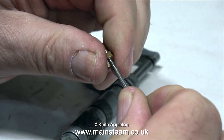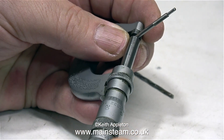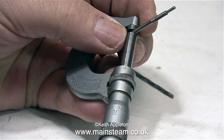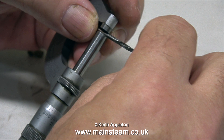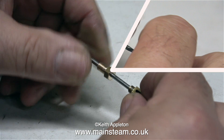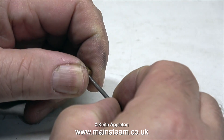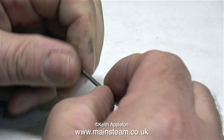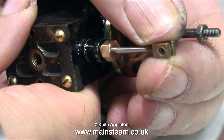So I'll just check that the valve rod is actually 3/32 of an inch. Rather than using a digital caliper I'm using my very old micrometer, and I'm comparing the size of the shaft to the shaft of the reamer, which one presumes is exactly 3/32 of an inch. So why doesn't the valve spindle fit? Well, the solution is surprisingly simple: this is a piece of stainless steel, and when I threaded it the threaded part got slightly distorted and the die raised a burr on it.